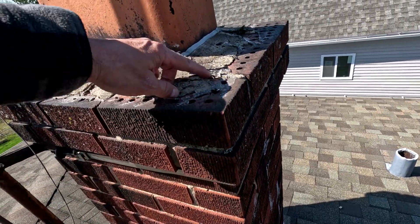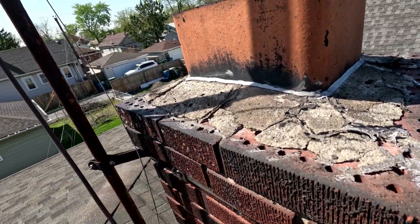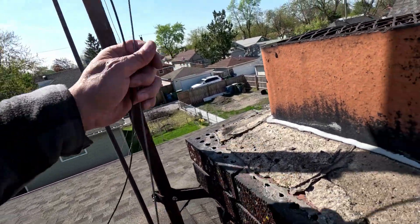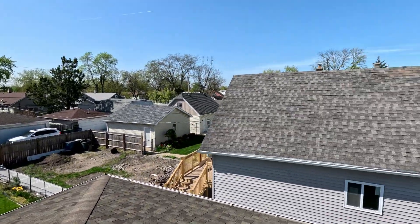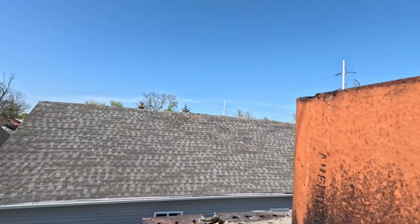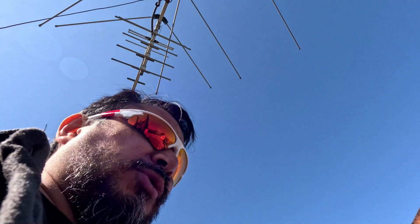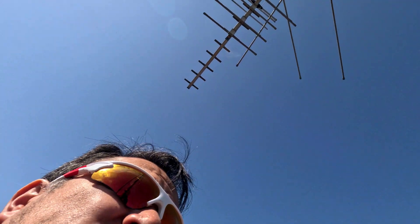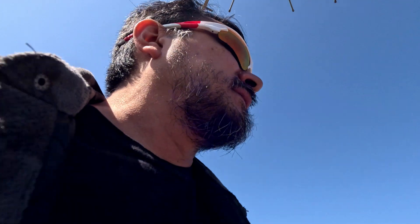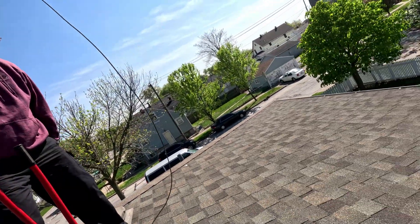See, when water gets into this it starts to disintegrate. So we've got to fix this too — this right here is just mortar, but it's supposed to be concrete. There's actually a concrete thing you can put down, or you screw in two-by-sixes, mix the concrete, bring it up, and pour it in here. It's good that they've got this cover so a bird doesn't go down in there.